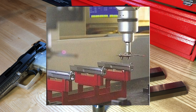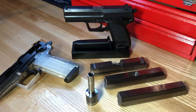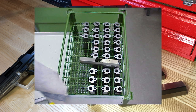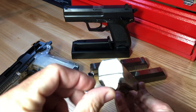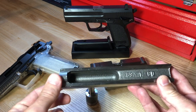The slides are milled three at a time from a solid block of steel. As a cost savings measure, scraps from this process are sold back to the steel company for future purchases. Here you can see a factory chart showing the progress of slides through the production process, and a rack of slides being completed. I'm very lucky to have three USP compact slides representing these phases of production — the first fresh from initial cuts, showing very sharp angles and brief initial cuts to the inside.